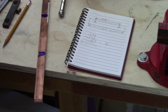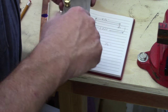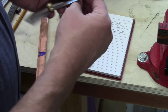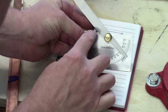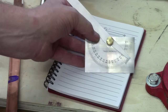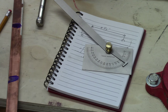The other thing we need to worry about — which is not very often — but it's worth checking, is the angle on these countersinks. Most are 82 degrees, or 41 on a side. We'll take our little angle gauge, set it at 41 and see if it lines up. You can see that at 41 degrees it lines up — so that's a standard 82-degree countersink. This looks like a half-inch. So we'll just use a half-inch countersink, go down a little extra deep and we should be good to go.